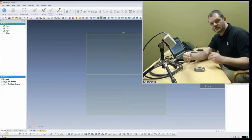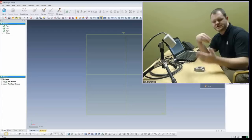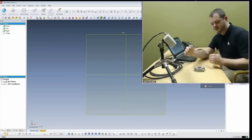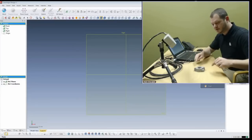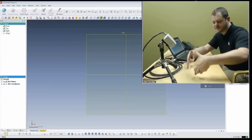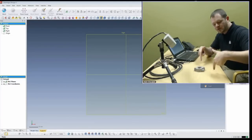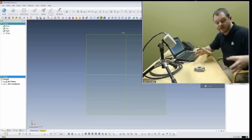The depth of the field of view is about 180 millimeters - this is like when you have an SLR camera and have the distance you're focused within. This is the distance where you'll have the best capture of data. In the front, because this is a trapezoidal shape, we're at about 124 by 120 millimeters - that's the size of the box. In the back we're at 192 by 175 millimeters, so you can scan very big parts.